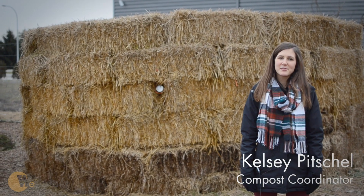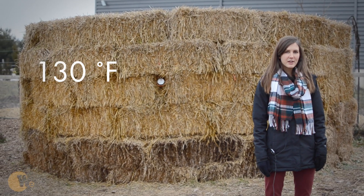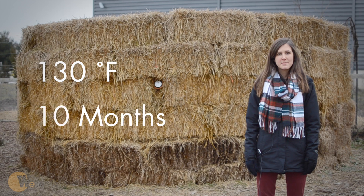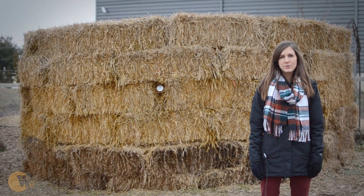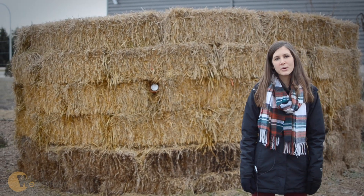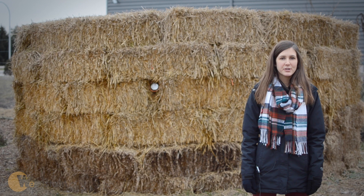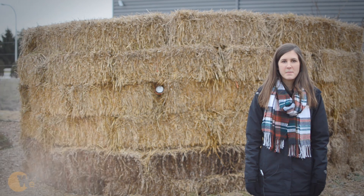Hi, I'm Kelsey and we're back at the compost heater one year after we built it. The system reached about 130 degrees Fahrenheit within the mound for over 10 months. We increased the temperature within the grow beds and we broke down material within the compost mound to use at the Gibbs site. Moving forward, the mound core will be redesigned to allow for better heat transfer, and a new compost recipe is being considered to increase the decomposition within the mound.